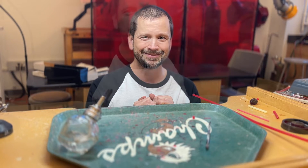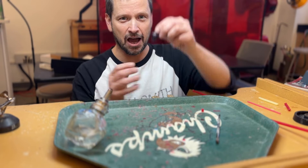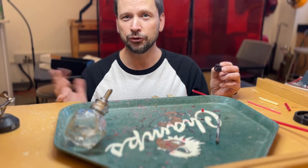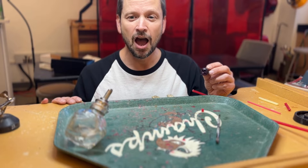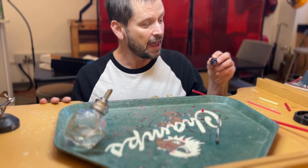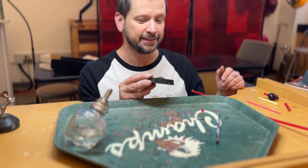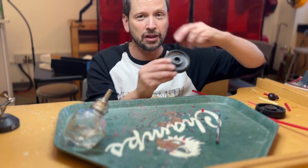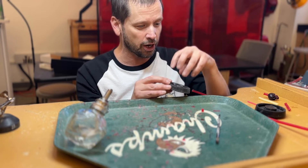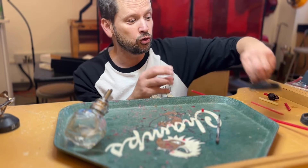So let's get into it. Today we're going to be investing Jack Skellington, our little mascot that was 3D printed. I did not do the wax working on this, but just to show some basic sprueing approaches. We're going to be attaching them to a flask base. If you select the donut-style flask base and you're not working with thicker rods for big casting trees, it's really important to fill it in.